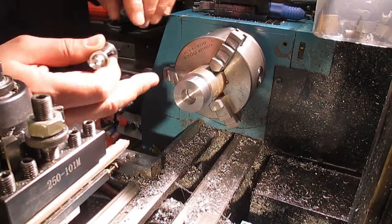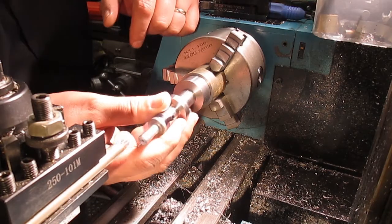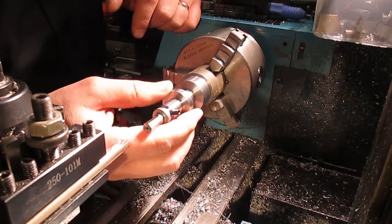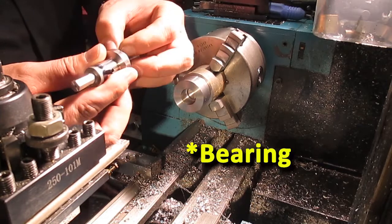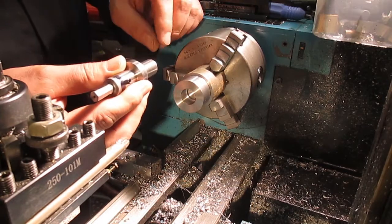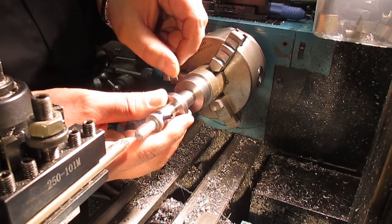Initially it didn't fit, so I've just done a spring pass in there and we can see now that that is a nice slip fit. It's really just to take up the space from the thrust washer to the bearing that sits at the bottom, with a plate in between.